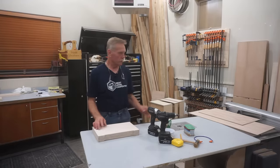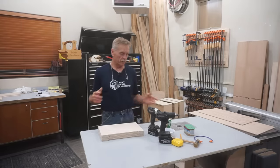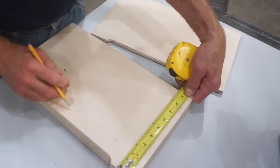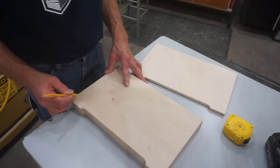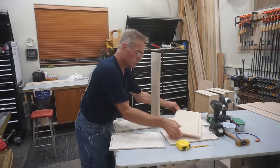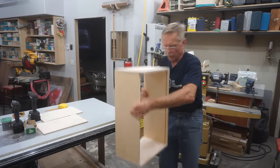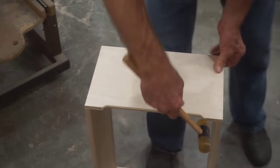Down to the point where I've just got two more drawers to preassemble, and I'll zoom in on the process that I'm using, kind of switched it up a little bit to make this go quicker, easier, and more accurately. The bottom drawers are the deepest, so I'm using 3 screws in these, 1.25 down, 4.5 down, 7.25 down, or 7.75 down. That spaces them out pretty well. And I just duplicate that on all these end panels. Because of the tight fit of the joinery, I can just snap these pieces together, putting the back with the good side up, like so. And because everything is press fit, I can set the whole assembly on the floor. And I just make sure that the top edge here is perfectly flush before I drill the pilot holes.